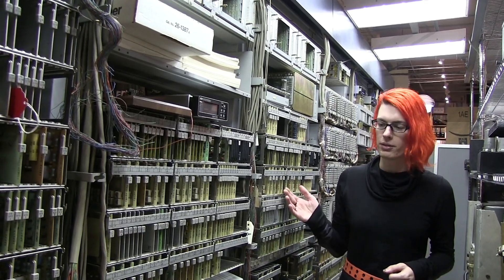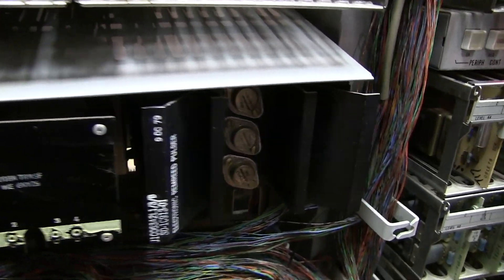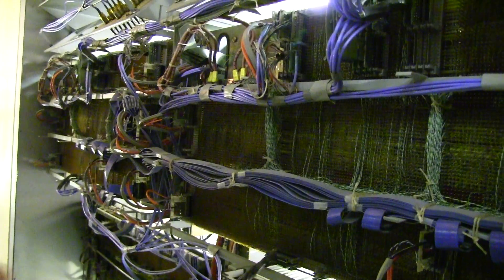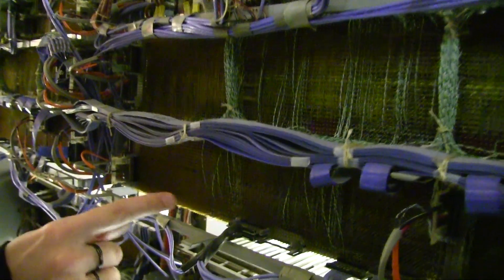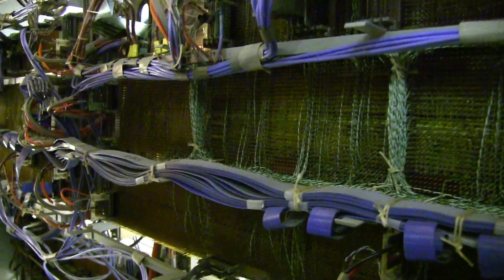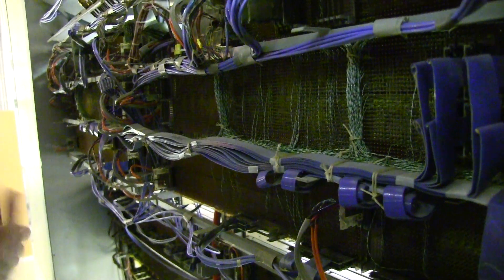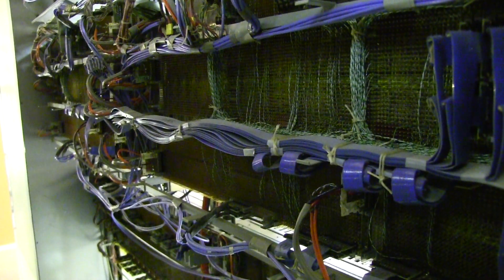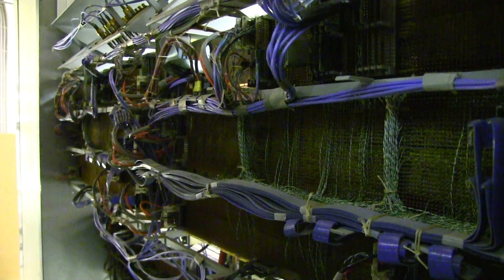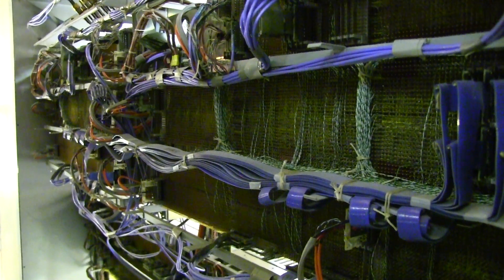This control frame has a number of circuits on it. Most prominently is the pulsar circuit, which operates those magnetic coils in the network. This backplane we're looking at is actually the rear side of the central control — the processor. There are all these pins connected by 30-gauge wire wrap. This was wired by a machine — a robot wired this — and it connects all the cards together. I believe they used wire wrap instead of a PCB because it makes it much cheaper to make small design revisions: you only have to change the instructions given to the robot, rather than drawing up entirely new artwork.